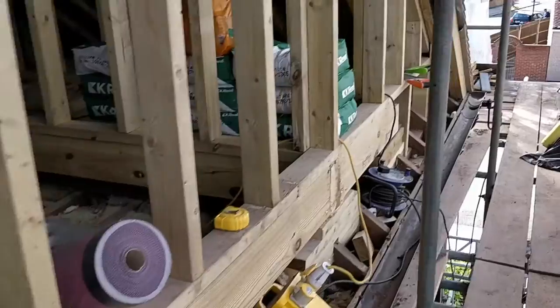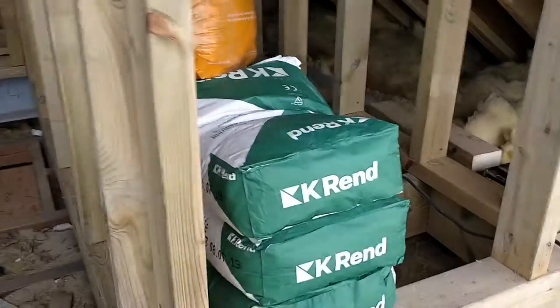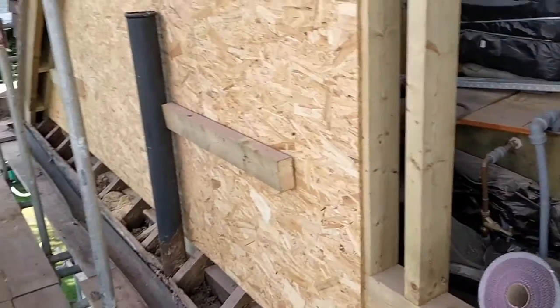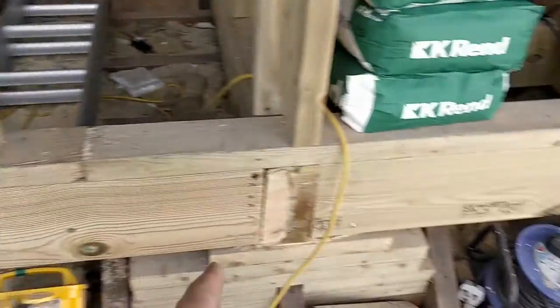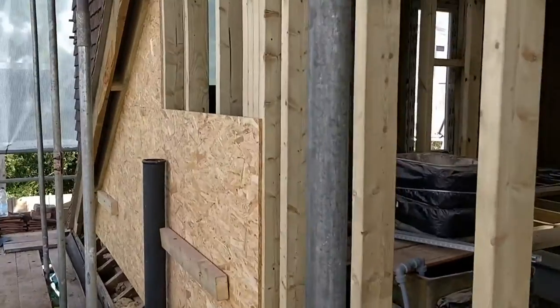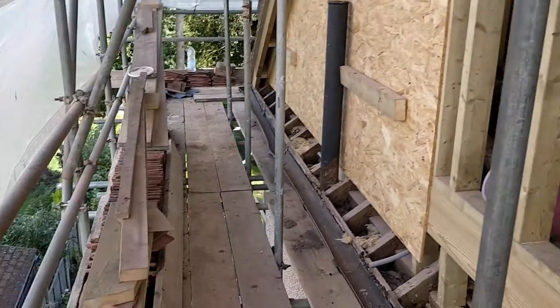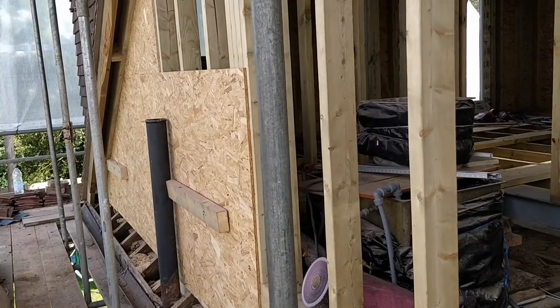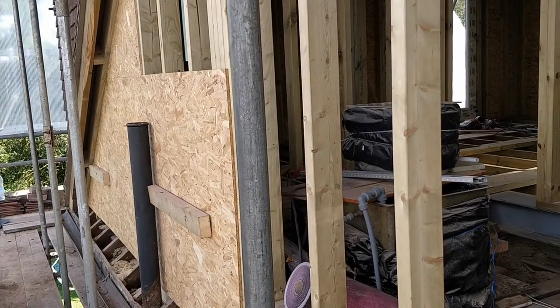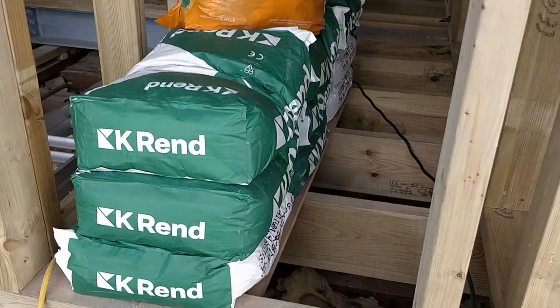That's how you work out the area of a triangle and figure out how much material you need — in this case, K-Rend. I've only got ten square metres, give or take. The bottom section isn't going to have as much render on it; I'm going to put a board up and square off probably a metre and a half or two metres squared at the bottom. Also, none of this is going to be seen after I've done it, so it's a bit of a freebie — well, I've paid for the materials — but it's a practice run for when I come to do the outside. If I do a really terrible job, I know I've got to pay a professional. If it's not that bad, I can save quite a bit of money doing it myself.